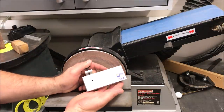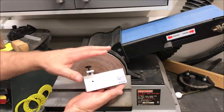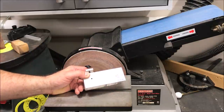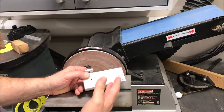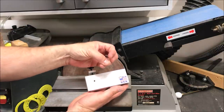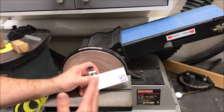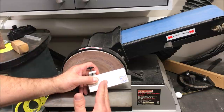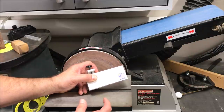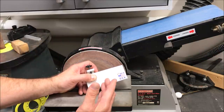This is my sanding jig and I absolutely love it. I got it from Tim Geist — Tim makes and sells them at the Classic Nib and Turner's Warehouse. They're relatively inexpensive and far superior to barrel trimmers. With barrel trimmers, if you have punky or soft wood, they can pull pieces out of the end grain. They can also chip or damage acrylic blanks. And if you're trimming a seven millimeter pin and then need to do an eight millimeter, you have to buy a separate shaft for every dimension — it must match the barrel dimension exactly.